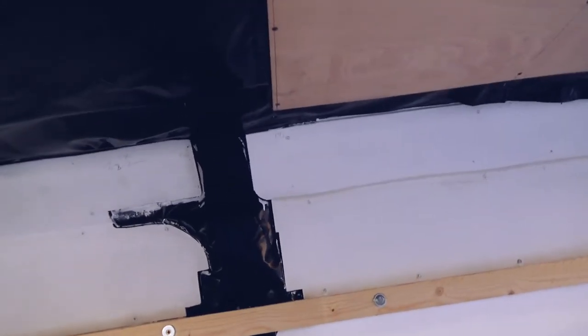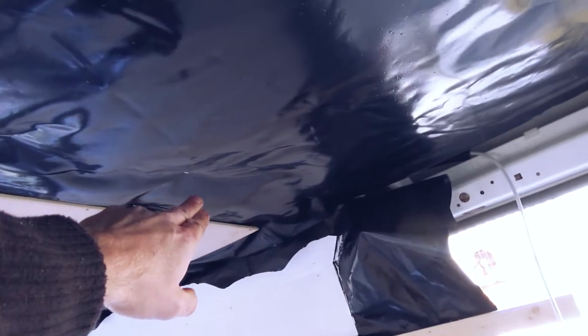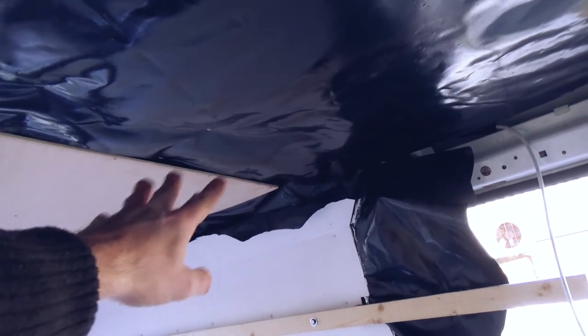There have been a few problems getting it up, and this will be helpful for anyone else putting a ceiling up: be mindful of where the edge of the ply is going to be. Where the boards are connecting, I should have put in a thicker joist where the two boards overlap — there's just not enough to bite into. For the last three screws there's no wood there — I can't go further to the edge of the ply because I'll split it.